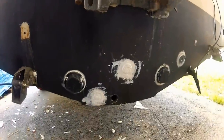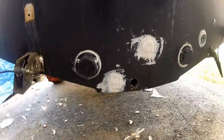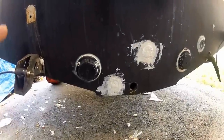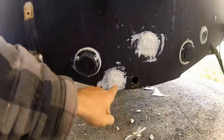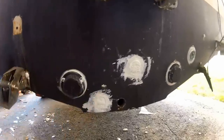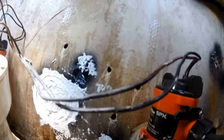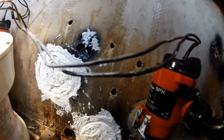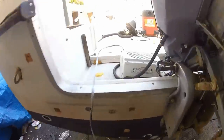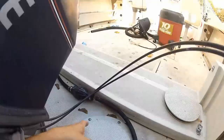I took the two sized plugs and filled these holes — there's a three-inch puck on the inside, and one-inch and one-and-a-half-inch on the outside. They were soaked in CPES penetrating epoxy and then MarineTex epoxied into place. When this is dry, I will sand that flat and add a layer of fiberglass mat and plug those test holes. The temperature was a little cold, so I put a small portable heater over the access hole to keep the bilge area warm and help the MarineTex epoxy cure.